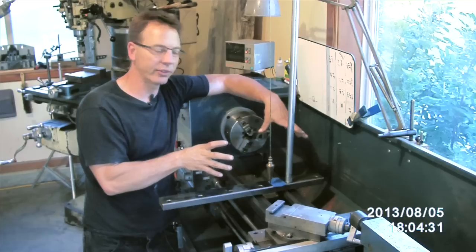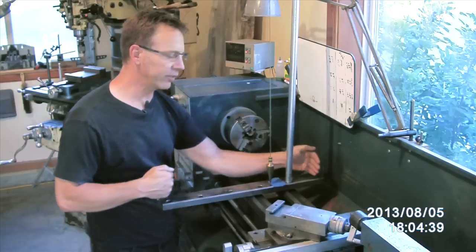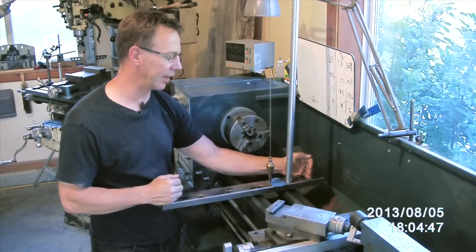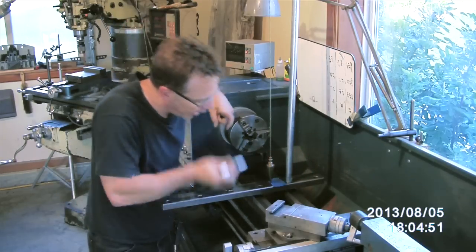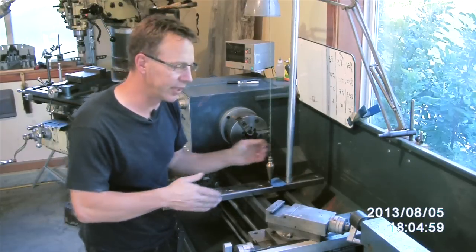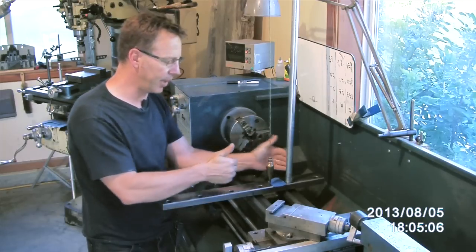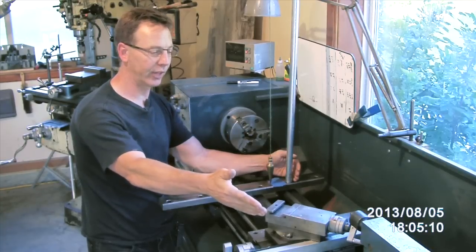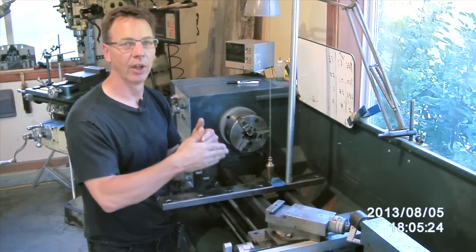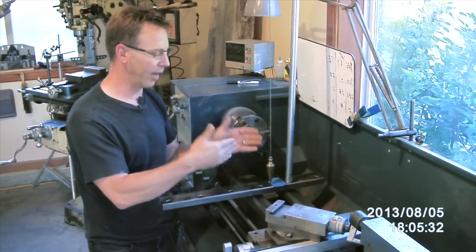It's a very simple device. It needs to be very flat on the bottom — we don't want it to rock at all. The chance of this piece of steel being totally flat is nil, so I did a little bit of work on it and flattened it out as much as I can. What we'll do is take a Sharpie and mark two points on each side — those will be our line-up marks. So when we move it to the other end of the bed, we'll put those marks right on this V-way in exactly the same position, keeping us lined up from one set of ways to the other. Let's clean the bed — I use just paint thinner and a paper towel to clean off all the grit and grime, and remove the tail stock. Then I'll show you the process of using this machine.